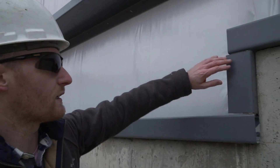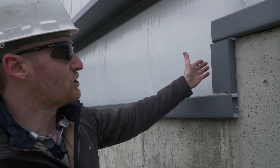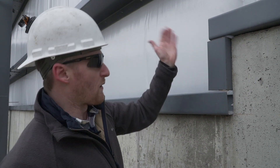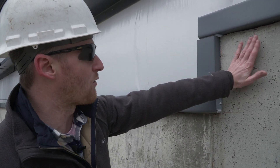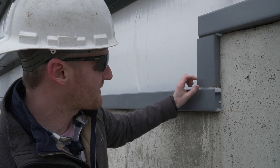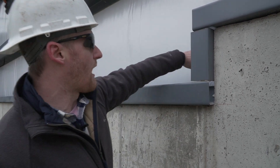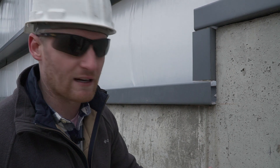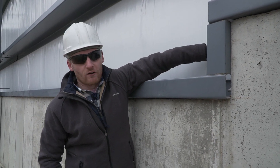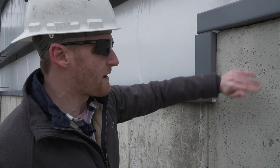This is just a purlin — basically to catch this outside drip edge when we're coming on a vertical. It's going to be planed out flush with the concrete on the outside, and that drip edge is going to come through and go down. This isn't the prettiest portion of the build, but it's not going to matter for weather because it's all protected. These areas will eventually be framed out, dry walled, and insulated. All this is doing is catching that flush part of the drip edge on the outside.